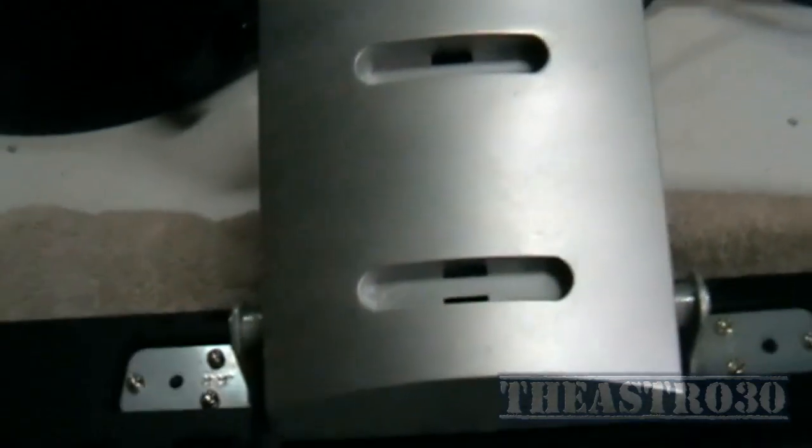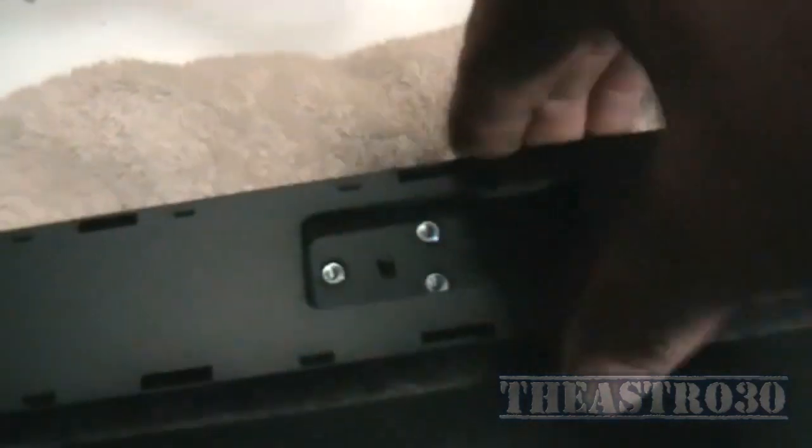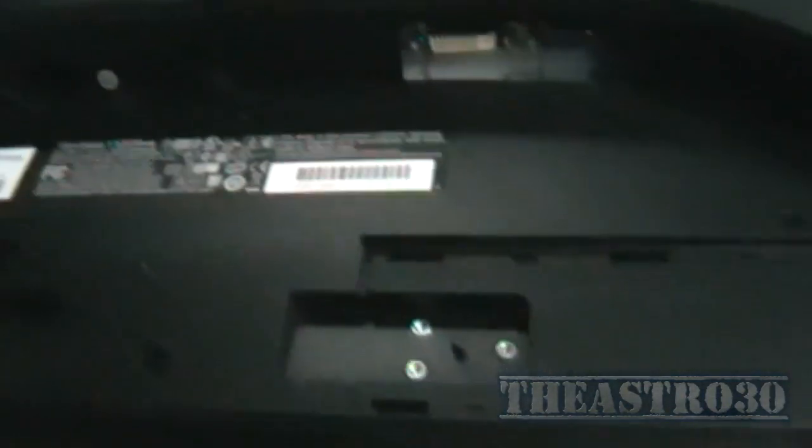These covers just popped off sideways. That revealed the screws for the base mounting — they go into metal threaded eyelets on the chassis through the plastic. I would have had to remove the base anyway to get the casing apart and find a hidden screw. With a bit of luck I should be able to start popping the casing apart. I've got a gap there now — I just used a screwdriver and pried it off the bottom.